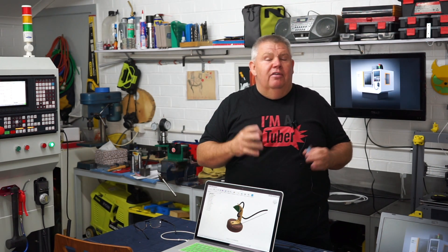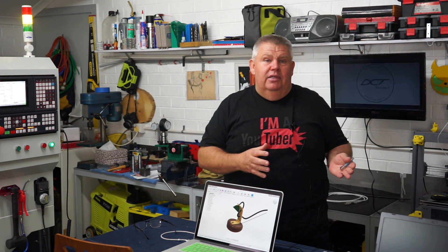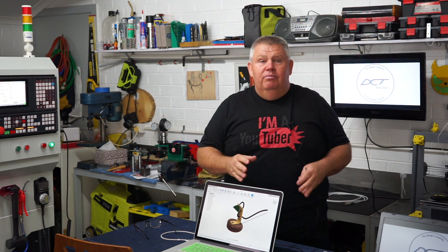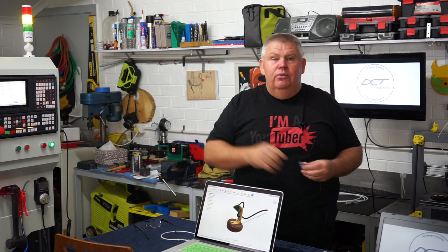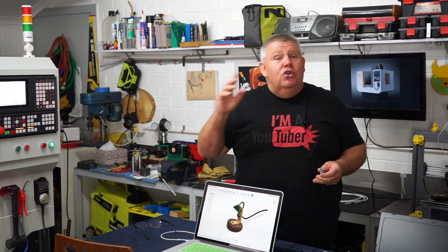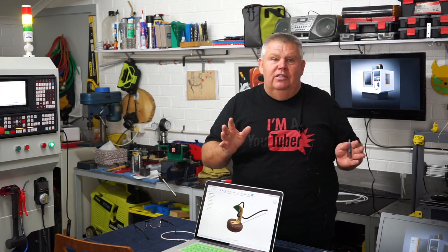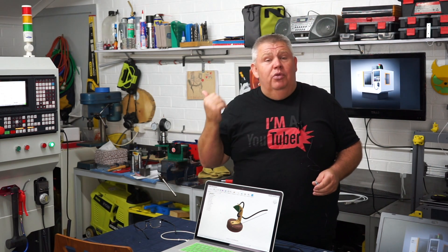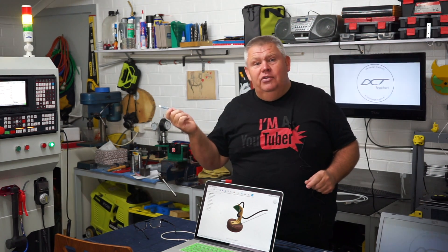You'll have noticed that I commanded a tool change and put in a 50mm shell mill. There are pros and cons about this — some people are for it, some against it. I personally don't like to spin the spindle up without a tool clamped in it. The trainers who trained me on the Haas machine said you shouldn't spin it without a tool in the spindle. One argument against it is that putting a tool in a cold spindle can cause thermal growth to lock or jam it in. I've been CNC machining for numerous years and that's never happened to me — I'm not saying it can't, but I always prefer to run the spindle with a tool in it rather than free and unclamped.